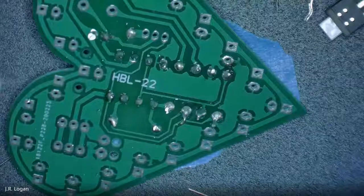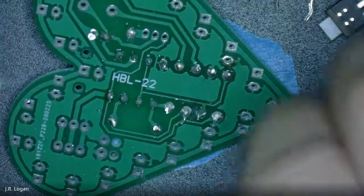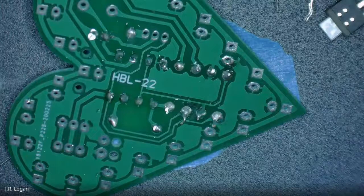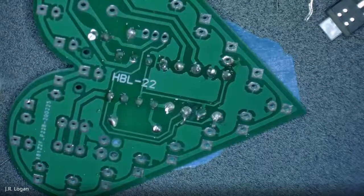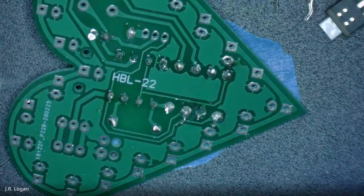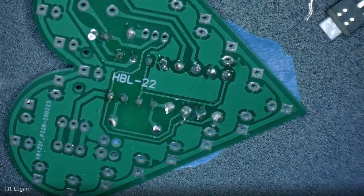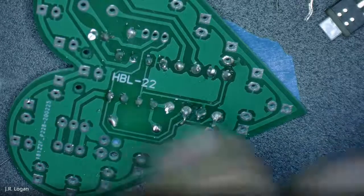I feel like, so it's clean, then touch it to the solder wire or the block of flux. I feel like it's not melting very easily. So a lot of times that's just the timing, and the soldering iron will have hot spots where it's hottest at the tip or elsewhere. There's a little personality there, at least I found. So it's getting that spot to touch the pad and the pin. The key is you want the pad and the pin to be hot and you want to be melting the solder on the pad and the pin, because that's where the reaction's happening.